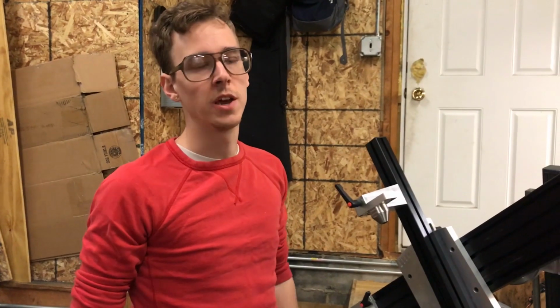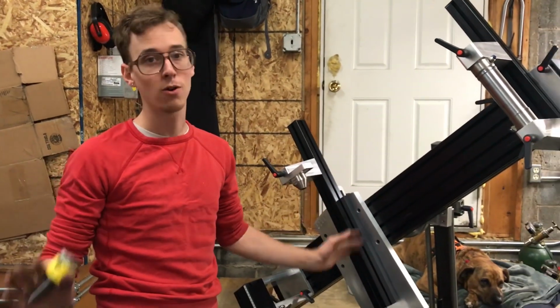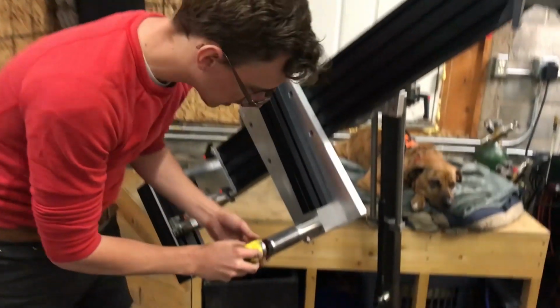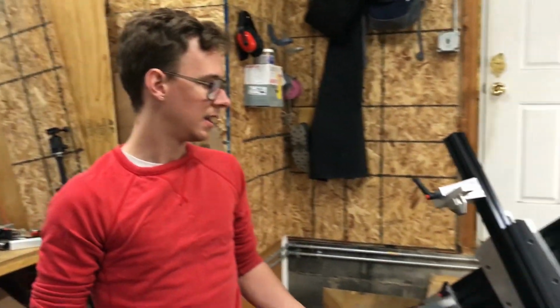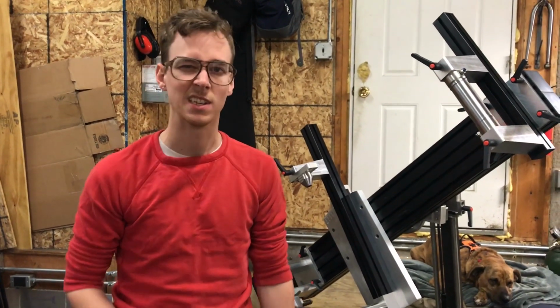So this is obvious, but I know that this bottom bracket shell is 1 3/4 diameter. I know that. There's no question about that because I've been thinking about these numbers. But a really easy check is just take the hole saw you're about to use and do a little visual check, an idiot check. Yep, that seems like the right diameter to me. It's really easy to screw some of these things up, and I learned that one the hard way at some point. I don't remember, but it's really easy to just hold it up and visually check. Yep, that makes sense.